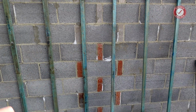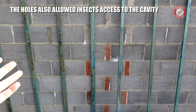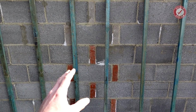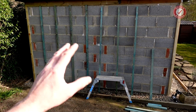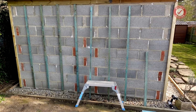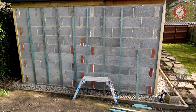And, you know, the odd little hole's not going to make that much difference, but across a building like this, it does all add up. So every single little gap and hole in the mortar, I've had to go around and fill with acoustic filler. Unfortunately, this was pre-Allen, and I think most decent bricklayers do joint all of the brickwork inside and out, but for whatever reason they thought that was too much hassle and didn't bother jointing the outside, whatever.